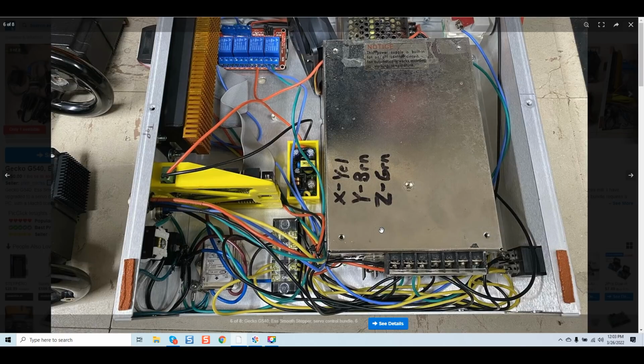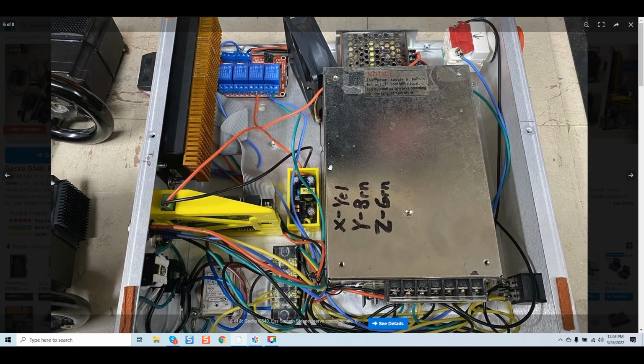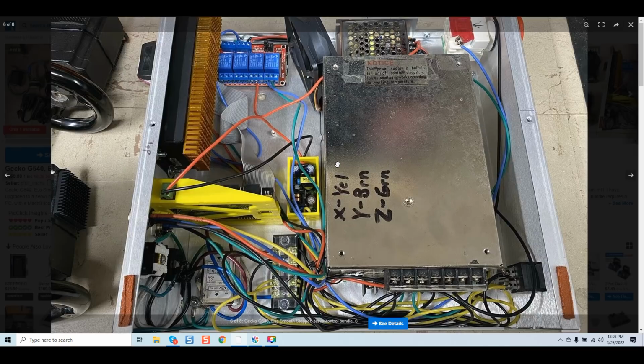I don't know. I'm going to tell you a real easy way to know if you want to question a seller, if the knowledge is there correctly. Just ask him to show you the shield drains from all the inputs and outputs that you're using. Okay? I've gotten asked that numerous times, and I love that question because I want you guys to see where they are so you understand it.